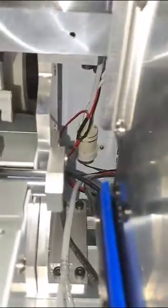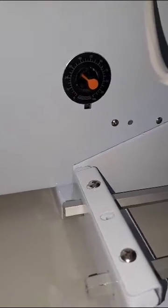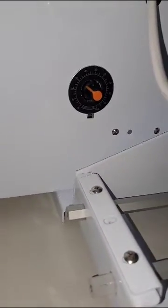That way you don't have a feeding issue on your dampers. From there, your pump is circulating the ink. That is the centrifugal pump at the back, controlled by the circulation setting. It goes up to 100 — I prefer putting it on 30, as that works best for me.